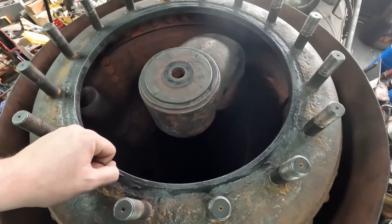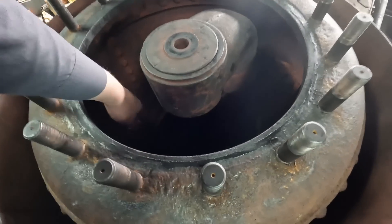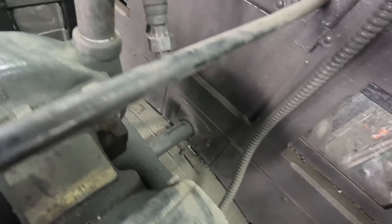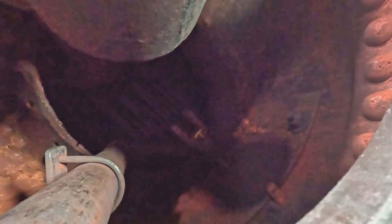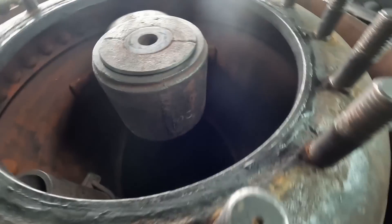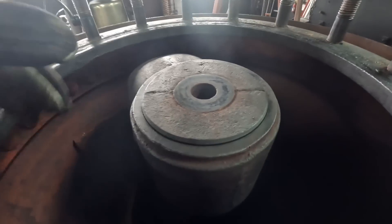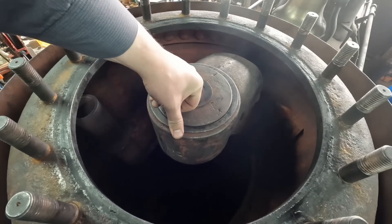This is the valve here. When you pull the throttle handle in the cab there's a crank that sits below this and actually runs a stud that sticks up through here. This pipe that runs between the dome and the cab is the pipe that the throttle rod runs in, all the way to where the throttle comes out in the packing gland in the cab. That clevis there with the T — that's actually the throttle rod. I'm used to looking at 491's, where the throttle rod comes in through the boiler and there's packing in the back head instead. 491 is a much bigger locomotive and a different design style. So when you pull on the throttle bar, that bar goes that way and then pushes or pulls on a crank that translates it into a vertical lifting force and picks up the plug.